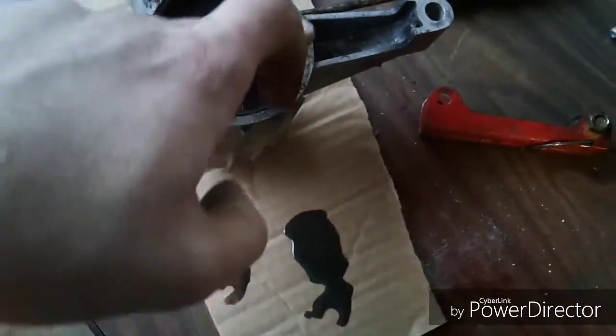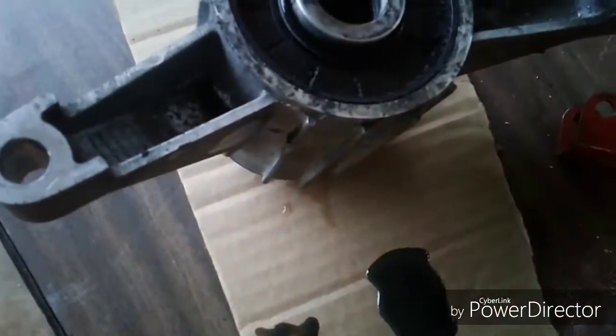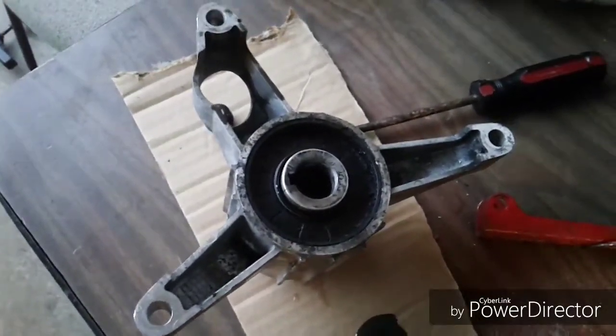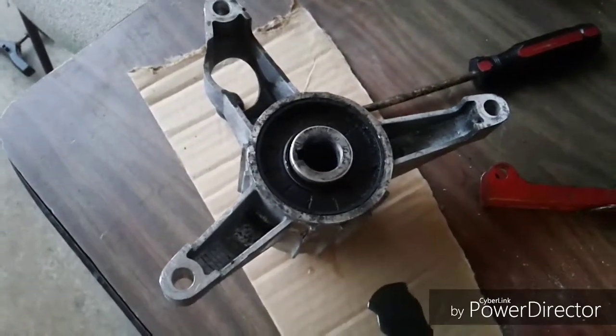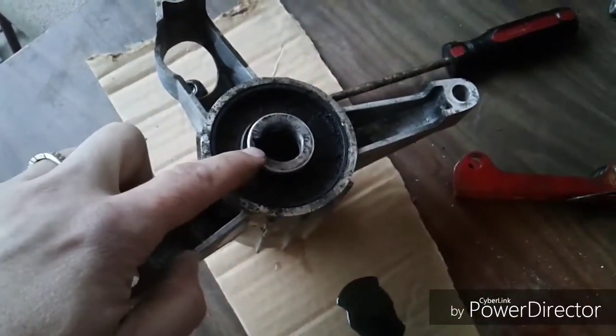And this appears to be plastic. And so I might be able to carefully pry that off and see what's in there. If I see some metal shavings or something weird looking, then that bearing has gone bad. It could be that just getting some fresh grease in there will help, but if this thing sheared the key, which is right here, and it goes into the shaft, oh, you guys can't really see that. Let's see. Yeah, it's too dark right now. It's early in the morning, but it's right here in the main shaft.